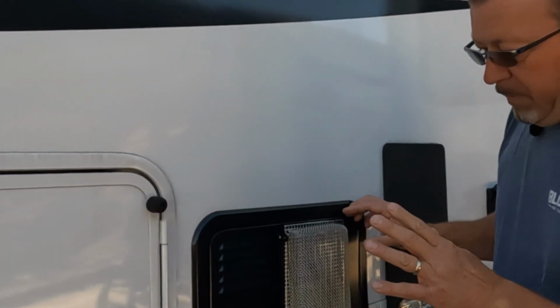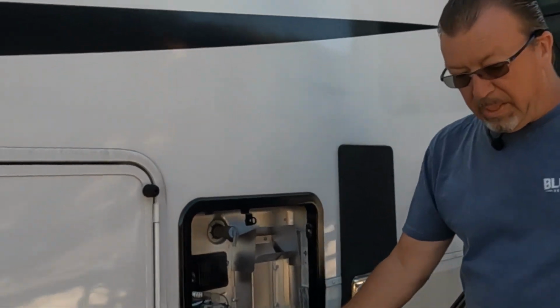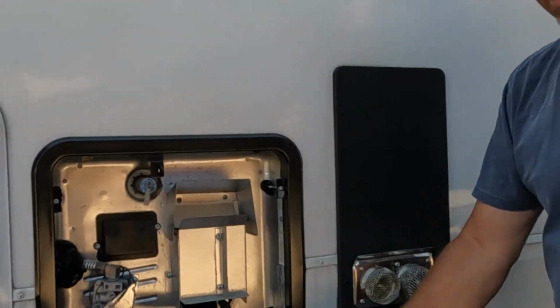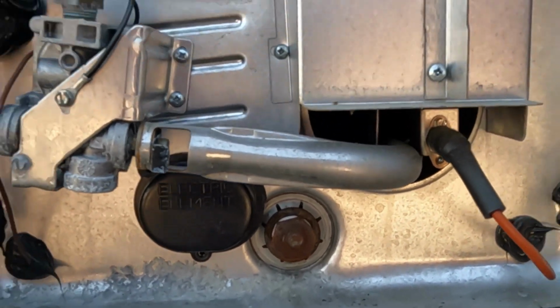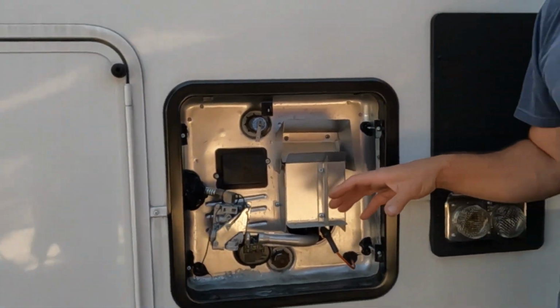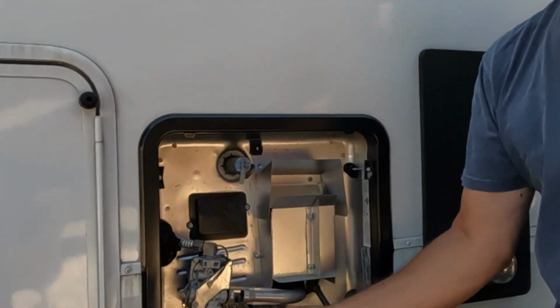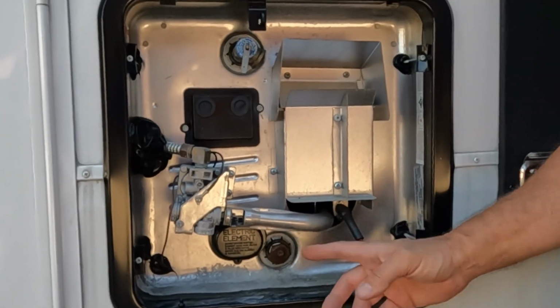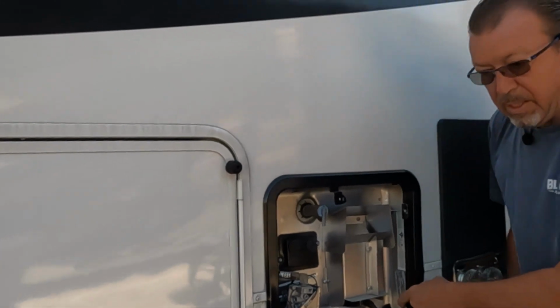So water heater, that's what we're doing on this particular segment. There are two things in here. If you have a Suburban, it will be an anode rod that you're going to have. If you have an Atwood, it's actually an aluminum casing, so they do not put anode rods. Most of the time, if this cover is a little plastic cover, it will be a typical Atwood. So just check the serial number or the name brand, like in here, it's written Suburban.